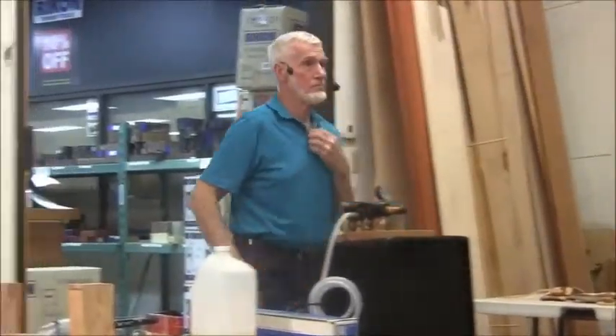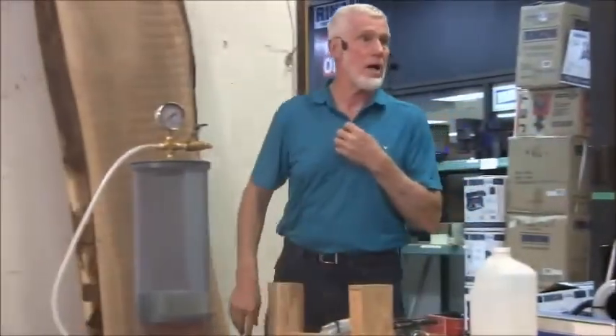I think there was probably more to it than just acceleration of drying — the wood was totally saturated with the alcohol, which I think decreased the tension on the wood. Do I have any scientific evidence? Nope — I've got a bowl at home that looks pretty darn good. The cheapest alcohol you can buy — denatured alcohol from your local paint supply, about $8 to $10 a gallon. You can't drink it. You might drink Cactus Juice and get by with it, but don't drink the denatured alcohol.